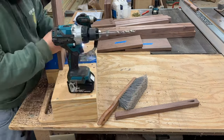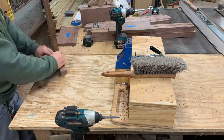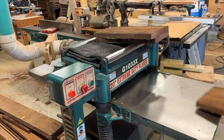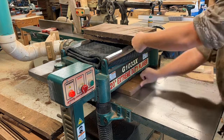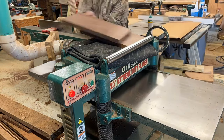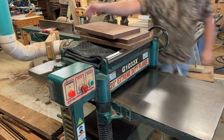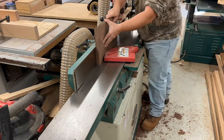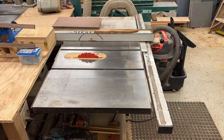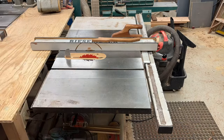And this is probably one of the parts where a lot of people are going to go crazy that I did pocket holes instead of mortise and tenon. I could have done mortise and tenon, but I needed to get the show on the road, needed to make some progress, because the deadline is coming up quick, and I have other things that I'm working on too, not just this. If I had all the time that I needed to devote to these, I would have done mortise and tenon, but I was also trying to keep the price point down for the people too, and pocket holes are plenty strong. I mean, especially for a nightstand. If it was a dining table, oh yeah, I would have done mortise and tenon, but, you know, sometimes we gotta do stuff to get moving along.